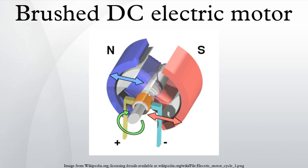Therefore, with a 100 V supply and a 25% on time, the average voltage at the motor will be 25 V. During the off time, the armature's inductance causes the current to continue through a diode called a flyback diode, in parallel with the motor. At this point in the cycle, the supply current will be 0, and therefore the average motor current will always be higher than the supply current unless the percentage on time is 100%. At 100% on time, the supply and motor current are equal.